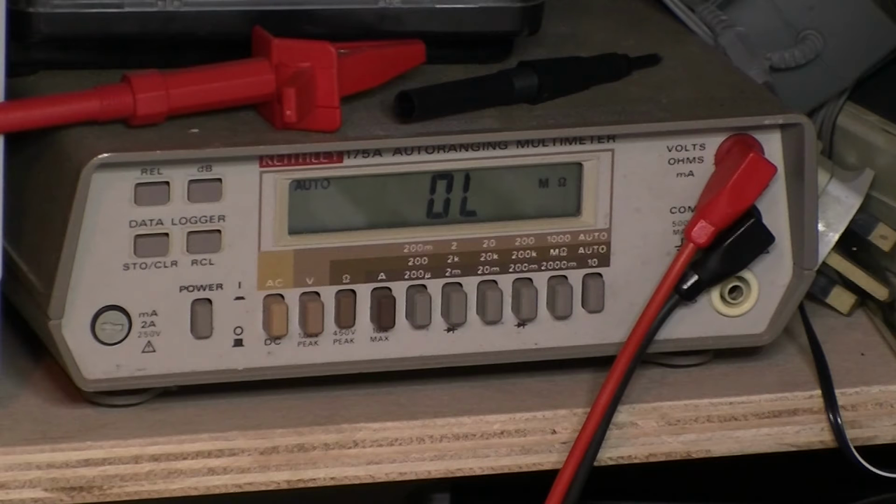Try this. This might be a bit better. So can to shield, dead short. That's my printer kicking into action now. Calibrating, it says. Okay, so the case to the emitter. Nothing on that one. Base. Collector. Yeah, so strange. There's nothing on that one.